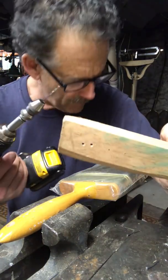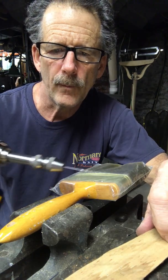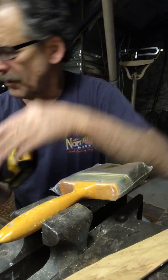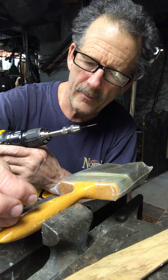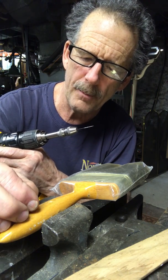I've already broken a couple of drills trying to get this done, but what I do is I taper down the point of the drill. Because you want the brad to bite the bottom of the hole, so the bottom of the hole has to be tighter than the top of the hole.